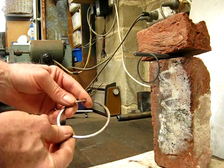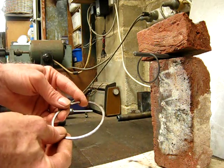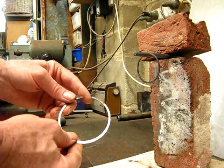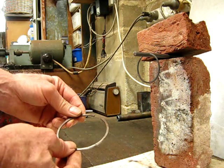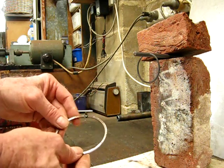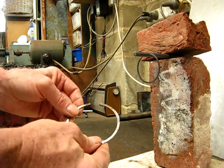That's the amount of tension the ring has got on it. Obviously you have to expand the ring for it to expand out against the cylinder walls. You can't just have a circular ring with no tension on it - it won't do much at all really. So how do you put that in there? How do you make that ring springy? How do you expand it out?